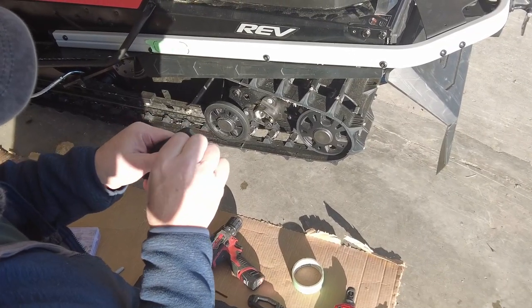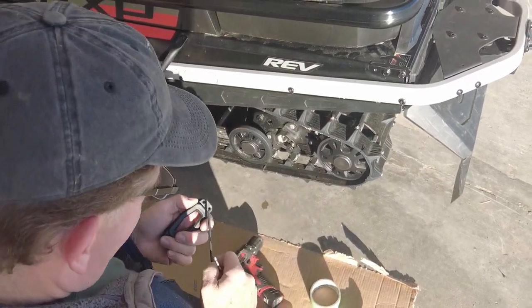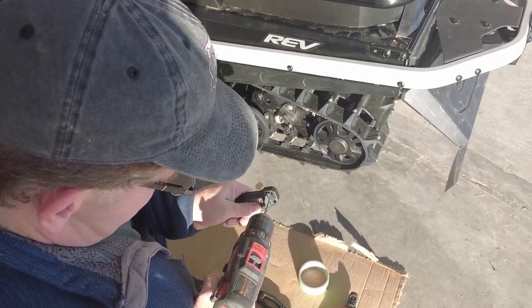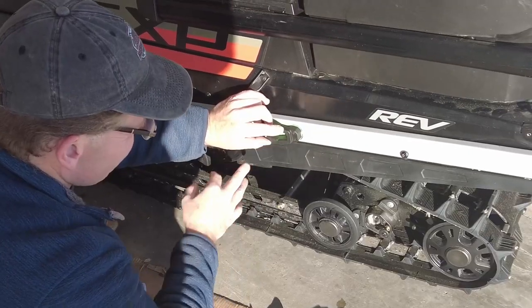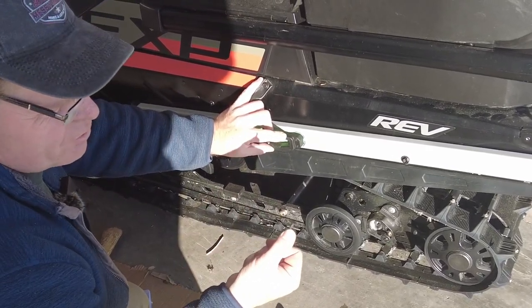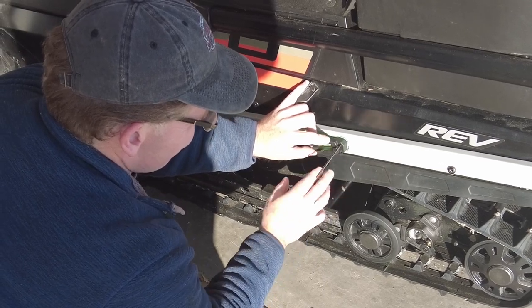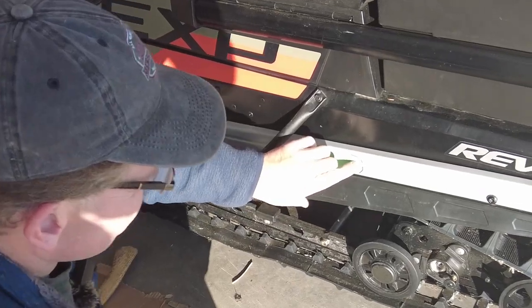What we're going to do is take a drill bit and run through these holes to open them up so that the transfer punch fits in there almost perfectly. Once we've got everything sorted out we might come along with the next size bigger drill bit and open these up so that the number 8 machine screw goes through with no problem. We're not taking much material out of these holes. Now the transfer punch is nice and snug. A transfer punch is a parallel-sided punch with a sharp point — they come in different sizes and you match the size to the hole. When you give it a tap it marks the center of that hole.